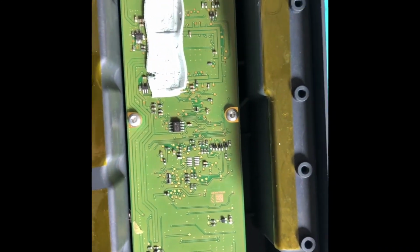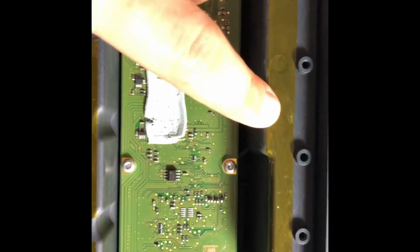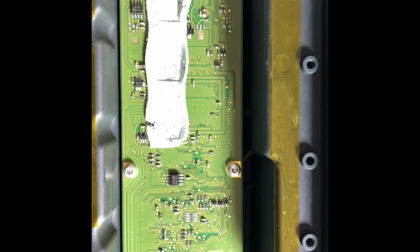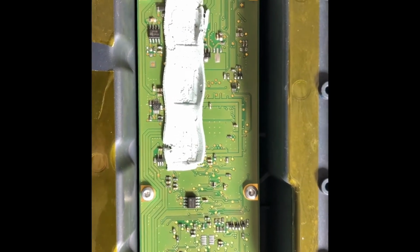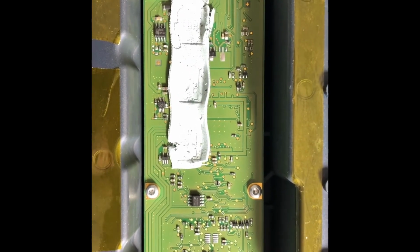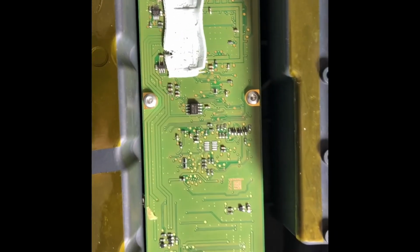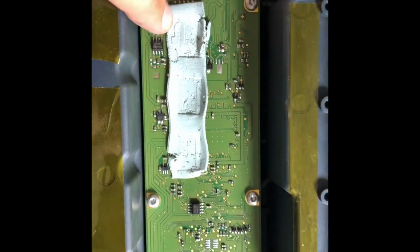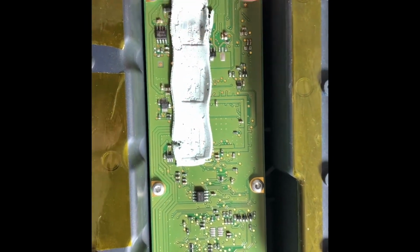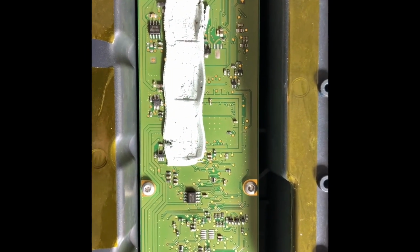Not just that, they killed the amplifier. It worked before that, and these heat sinks are not acceptable. This is just terrible, you know. Somebody who was working on this amplifier had no idea how the amplifier works at all, and still they upgraded it. That's pretty impressive. So anyway, I'm going to put everything together. The amplifier is back to life. So I'm going to put back the heatsink, so finally I can get the cooling back to normal state, and that's about it.